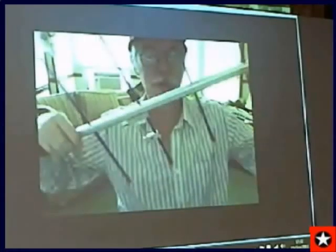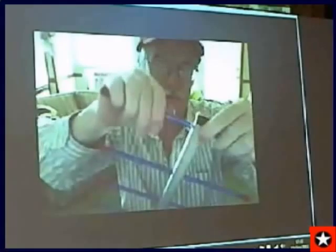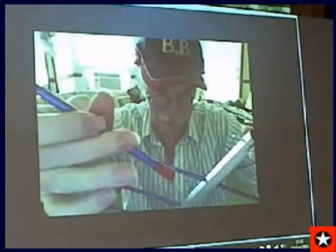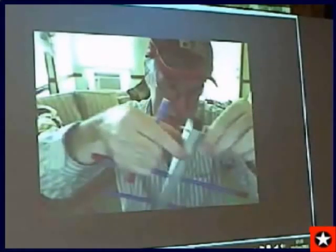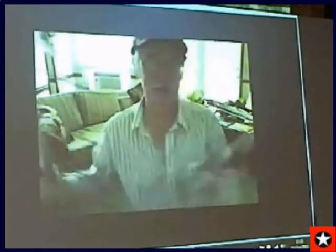This is an Arrow antenna. This is what I use in 434 megahertz. The nice thing about this, it's made out of arrow shafts. They unscrew, so you can disassemble this. Very compact. 434, you don't really need to disassemble. This is a 5-element. I also use a 3-element when I'm in the car.